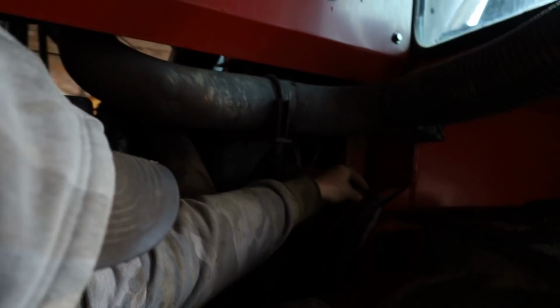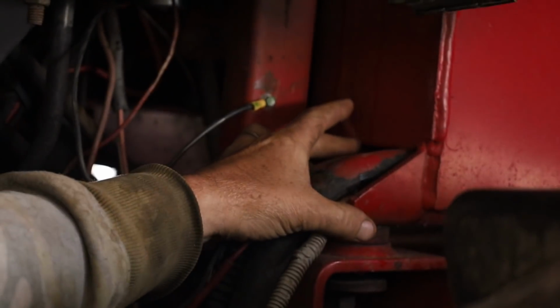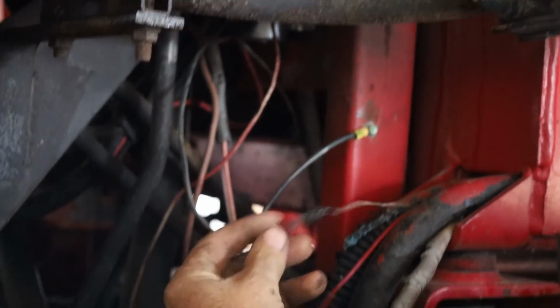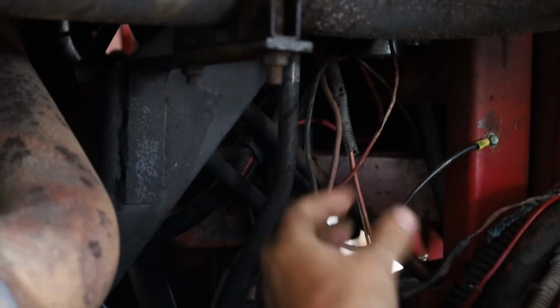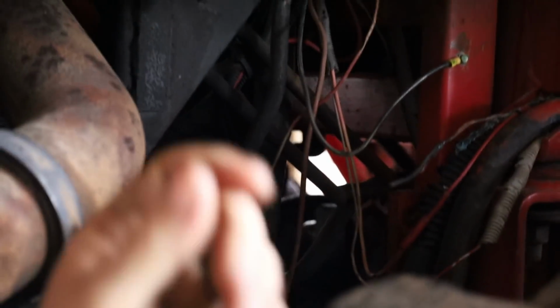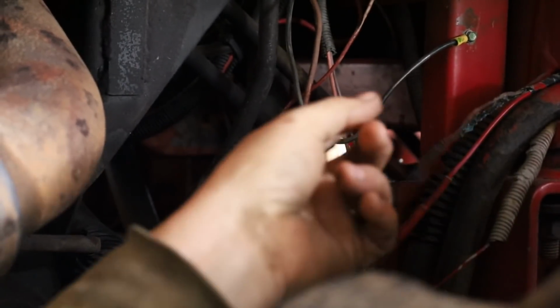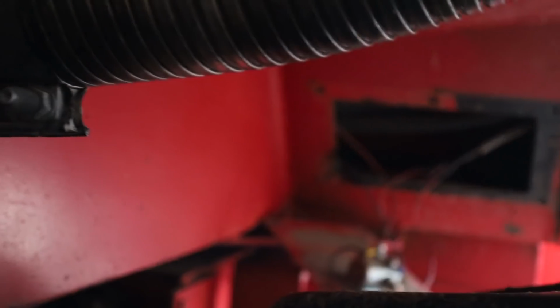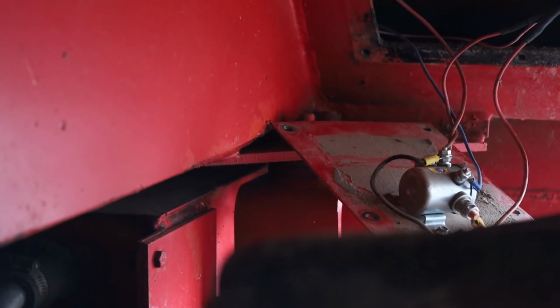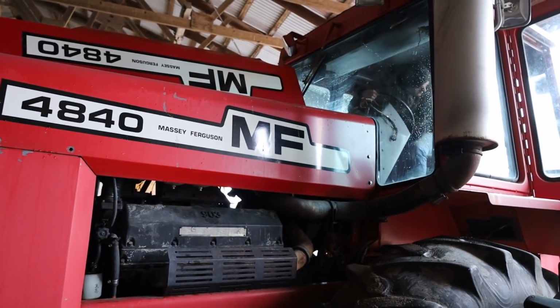This wire, I don't know if we got enough light to see it, but the wire here rubbed on the frame and basically shorted this wire out. It basically disintegrated it, but that wire goes right to the key, and every wire that wire touched burnt through in spots. So the boys are working on finding where this wire goes, and if you look back there, it goes to the silver relay in that cover, so you can see me moving it, what's left of it. So we're gonna put new wires in it, and that's what we're working at right now. Because right now it's dead in the water, won't start, won't nothing. So burnt the wiring harness to the key. So that's what Sydney's up there looking at.